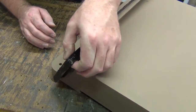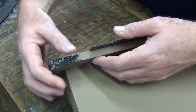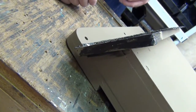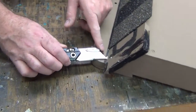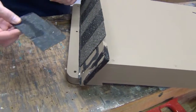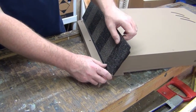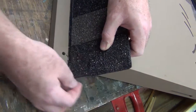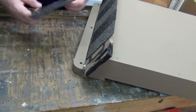You can see it made a decent edge and it didn't separate back out. It's still a little springy because the material is rubbery, but it's filled it in — no water is going to be able to get in there. So it's time to replace the shingle. We cut the bead off of the back here to make sure that was nice and clean and won't interfere. The shingle that you took off — if it's in good enough condition and you don't mind it — you can actually put it back and reuse that shingle. But what I'm going to do is put on a new shingle, and again, you can go to Home Depot. Weathered Gray is the color that we use.